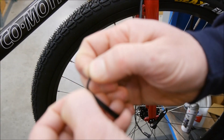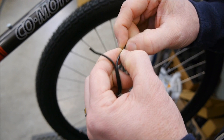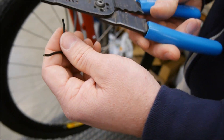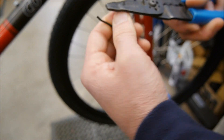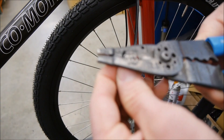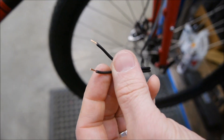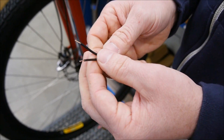Then I want to separate the two wires to give myself enough room to put the heat shrink tubing on, and also to strip the last quarter inch of the wiring so we can put the piggyback connectors on and crimp those on. I'll go ahead and strip these wires at the correct diameter. Then twist the ends so they don't come unraveled, which also makes it easier to slip the piggyback connector on.